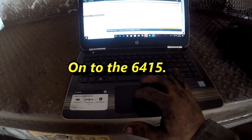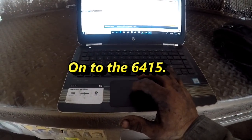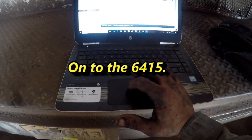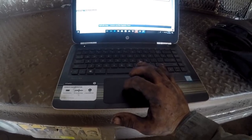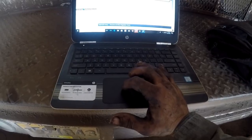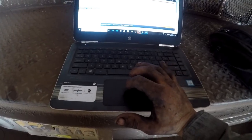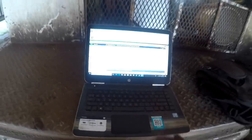Alright, so on this 6415, we're going to go to 140 degrees Fahrenheit on the oil temperature, go to 2300 RPM, activate the SCV, pay attention to the direction of flow, determine the flow rate, repeat measurement. Well, okay. Fully open the restrictor on the tester. Okay.